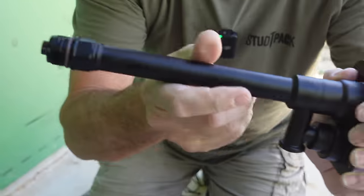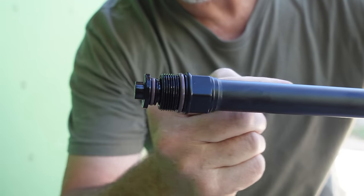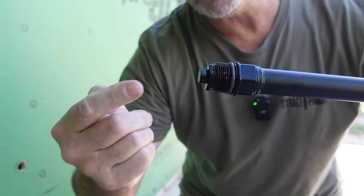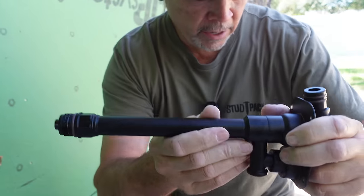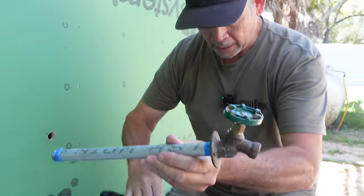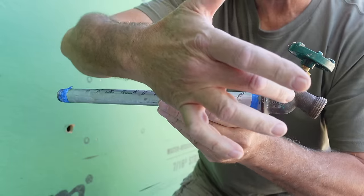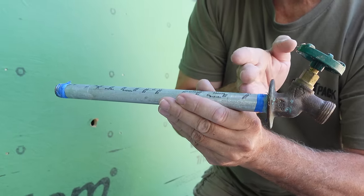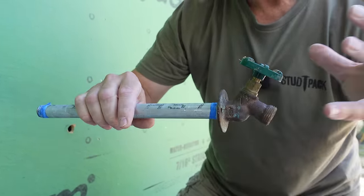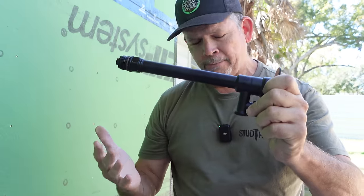The stop is actually where your valve is. When I activate the hydrant, water comes in here into this tube. When I pull this out, a spring and water pressure shuts it off, and any water that's in here drains out right here. Because when you put this in a wall in the wintertime, you need it to drain. Compare that to the old hose bib — we all know it's full of water up to about right here, because the washer that shuts off the flow of water is way back there. So the whole outside is full of water — that's why we put those foam things on them in the wintertime. The key feature of this one: it drains out. In order to drain out, it has to be at an angle. We measured it — it's four degrees.